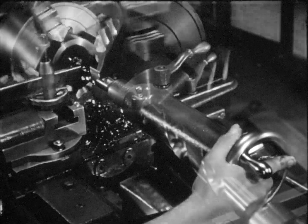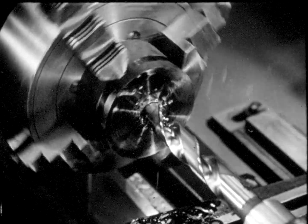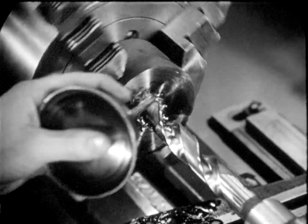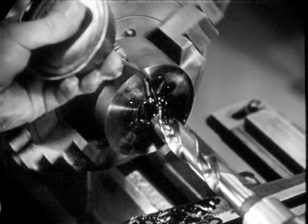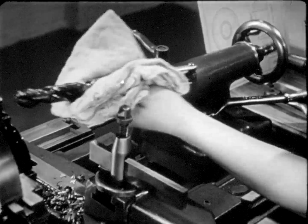In this method, a bar held in the tool post is used to guide the drill as it is slowly fed into the work. Once the drill has entered the work, the steel bar is removed, the lathe is started, and the drill is hand-fed into the work with an easy motion. Cutting oil is used for lubrication. The lathe is stopped, and the drill is removed.